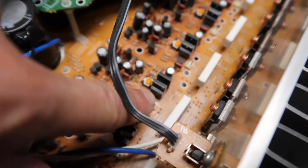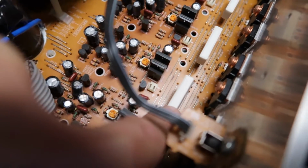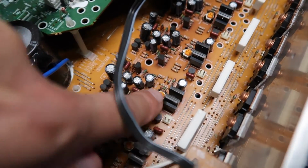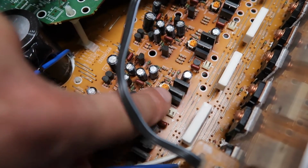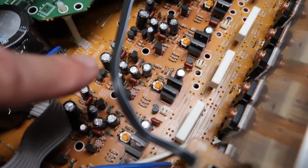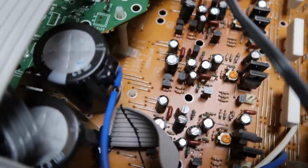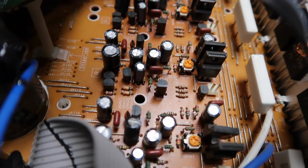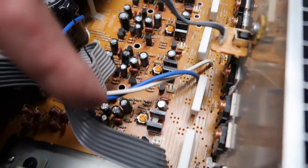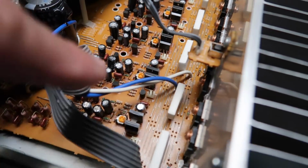Going back to the amplifier, if we just look at one stage, this white thing, typically those are power resistors, although I can't be sure. These may be some amplifier stages to drive the main power transistors, and we've got some miscellaneous small signal transistors and passive components, resistors, capacitors. And just visually speaking, you can tell that these are just repeated units, one after the other.